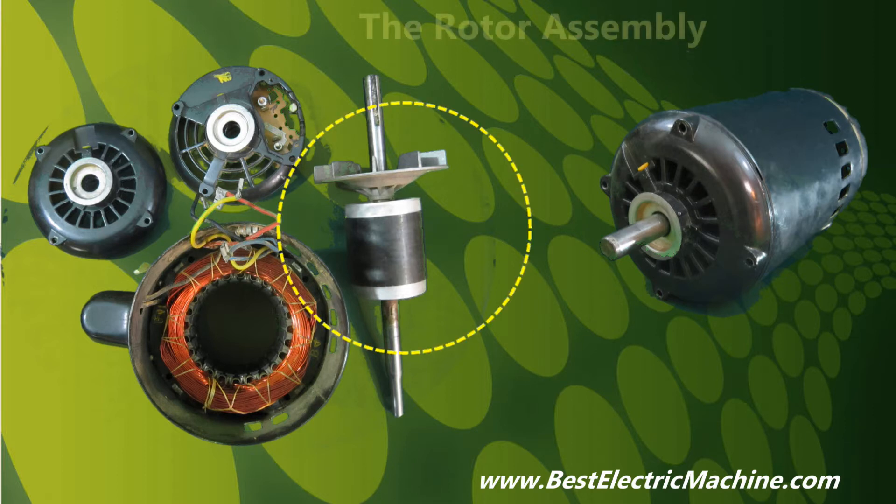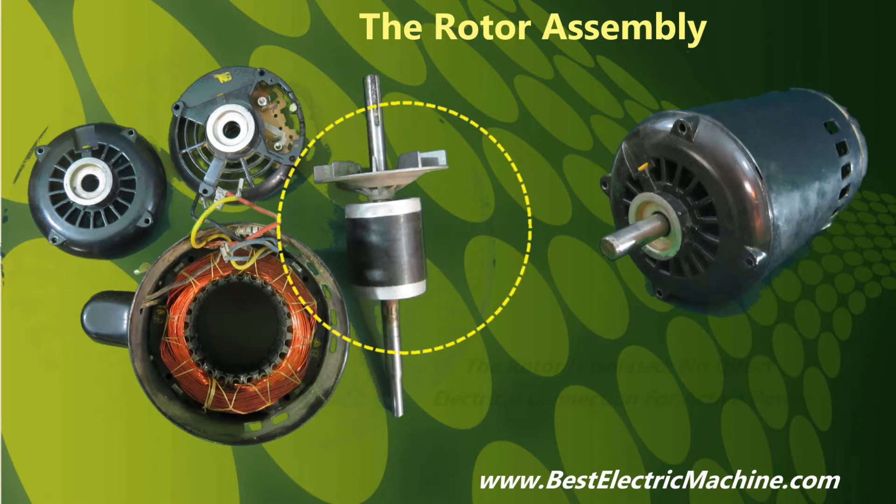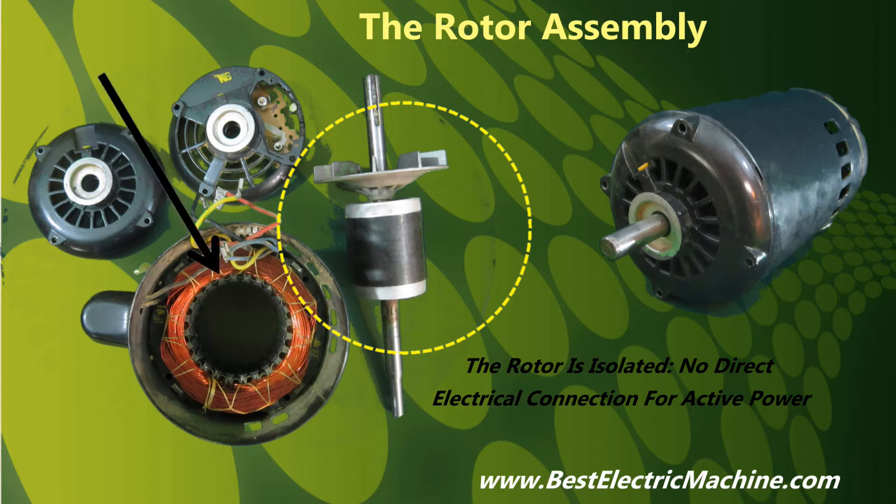Second component, the rotor or rotating assembly, which for this standard induction electric motor example includes the so-called squirrel cage winding set. Without an independent, bi-directional, multi-phase electrical power connection to the terminals of the squirrel cage winding set, the cost, size, and electrical loss for a rotating electrical connection means are conveniently eliminated, but unlike the stator, the rotor cannot actively contribute electrical power to the electromechanical conversion process. Instead, the rotor is a mutually inductive coupled component of the stator active winding, powered by a speed-based asynchronous movement or slip phenomenon called slip induction.